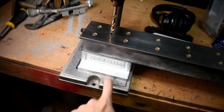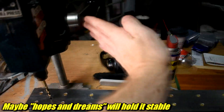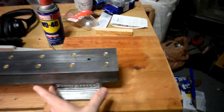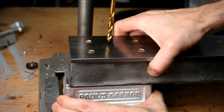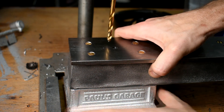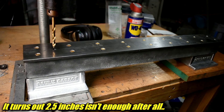To drill these bases, I have to kind of rig this thing up here. I want it sitting on here because it isn't bolted down, and this is the only way to have it even remotely stable. This thing can swivel off to the side, so there's no way that's even remotely stiff. I have to raise the other side up, put on this block of cherry, put it on the other foot. This little raised section actually works pretty well — I can slide it to the side and it just hits the edge and it's pretty stable. I'm going to get this set up and clamp this down.